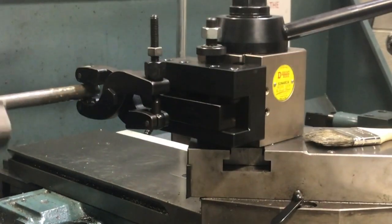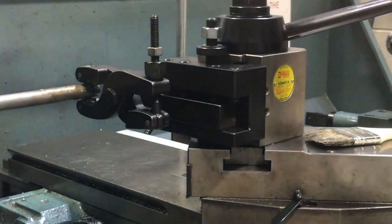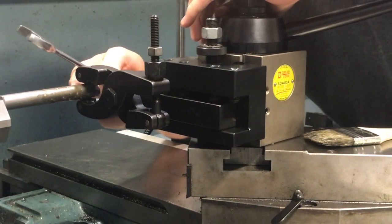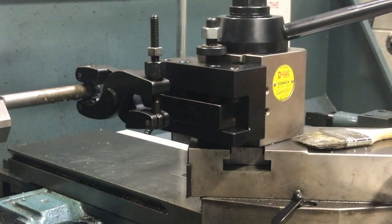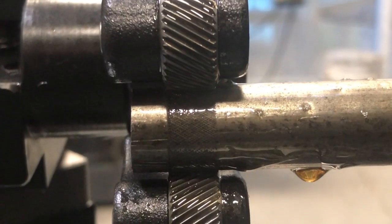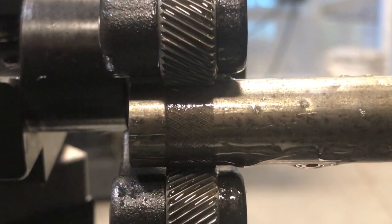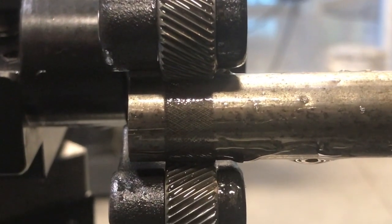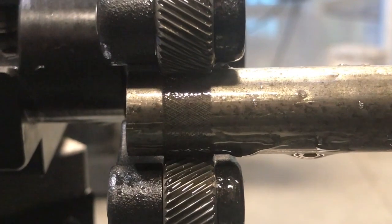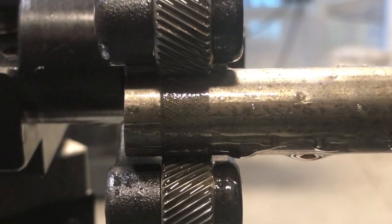You don't want to just flip it off — you want to make sure that you don't remove the tool. You never want to start a knurl and then stop. You can take a look on the back side; you can flip that really fast. After a little bit of knurling, just check the back side and see how that knurl looks. Right now it's pretty soft, so we're going to do a little bit more tightening and then move into actually knurling down the part.